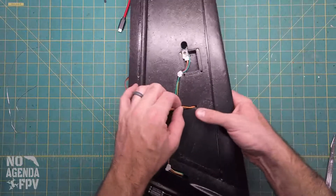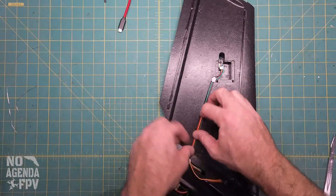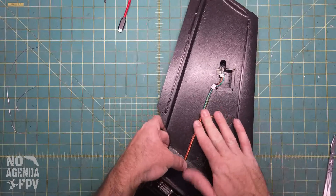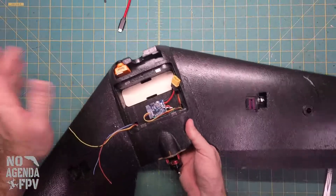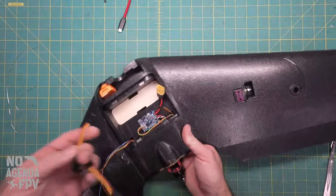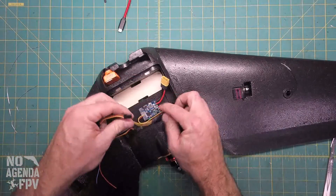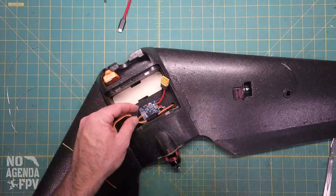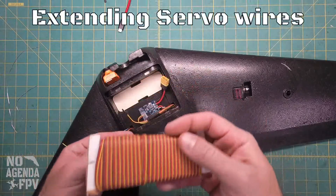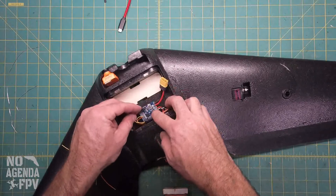I'll wrap this through — even cleaned up the bench clutter. Now what you'll notice is my servo lead only comes to here and we need to get to over here. The S800 did come with these two servo extensions — you could possibly get by with those using pin headers, or cut them off and solder. However, what I prefer to do — I bought probably a couple of years ago about a hundred feet of servo wire. So I'm going to take this whole length, which should be plenty.